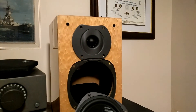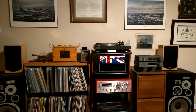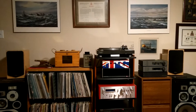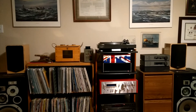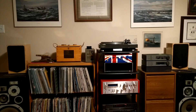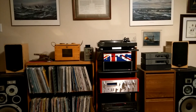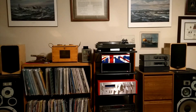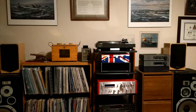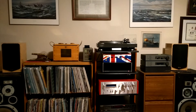I'm going to bolt all this back together, do a listening test, and see how it sounds. The sound test is absolutely conclusive — the speakers are now hooked up correctly. Imaging is coming from dead center between the two speakers, and I'm a happy camper. I've solved the mystery and proved that Quad is not infallible. They sound even better than before because now all four drivers are operating in phase. Before, we had one speaker hooked up out of phase from everything else. The imaging is a lot tighter and it sounds spectacular. Thanks for watching.